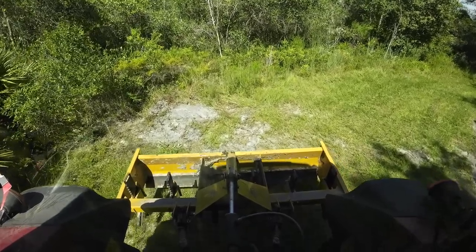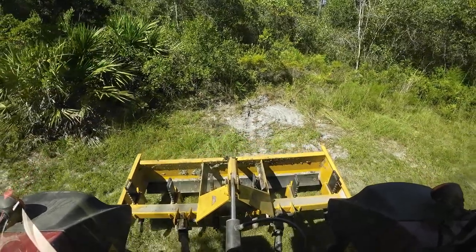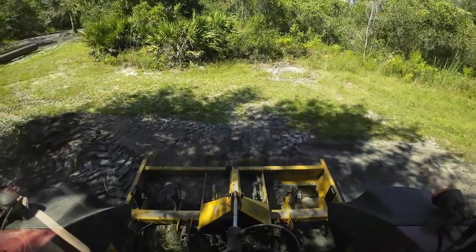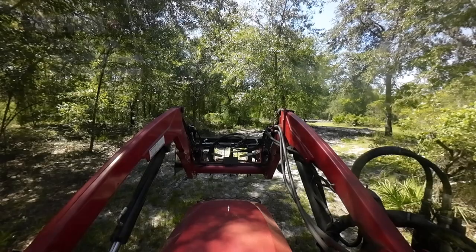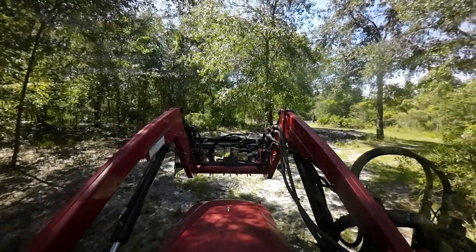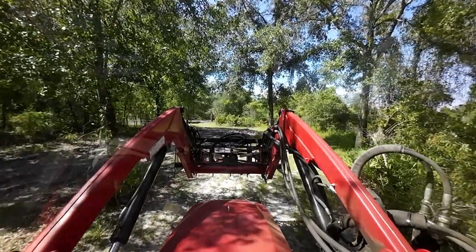If I had to do it again, I might actually buy a 90 or 100, 110 horsepower tractor. Some of the bush hogging that I do, I think it's a little bit heavy for this tractor, when I'm running something that'll cut a 4-inch tree. And also the engine has to work harder, at a higher percentage of its capability, to do those things. Here in Florida, it's hot, it's super hot. So if the tractor is only operating at 50% capacity instead of 90% capacity, it would just be able to do more and not work quite as hard.